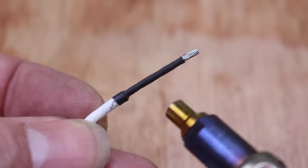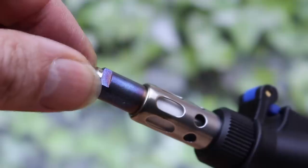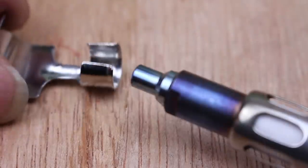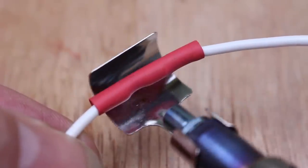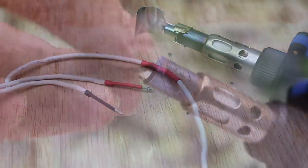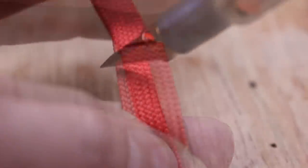Whenever I do an electrical job I also like to use heat shrink tubing to leave a neat and safe joint. For this, use the hot air tip which screws into the catalyst end — either on its own for gentle heating of plastic and shrink wraps, or you can also use the deflector which helps to deflect the heat around both sides of the wire, so great for heat shrink. For larger pieces you might also try the wide flame head with the hot air tip — whatever works for you.